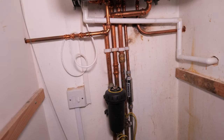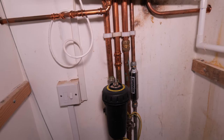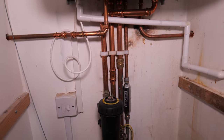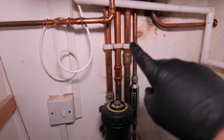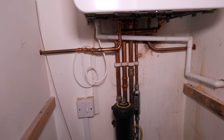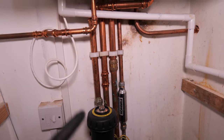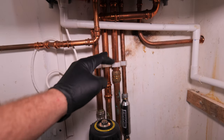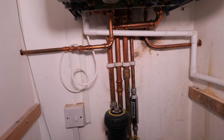One of the main things you need to do is add a zone valve on the flow coming out of the boiler. That will need wiring changes — linking it to your wireless room stat so it opens and closes depending on demand. We also need to put an auto bypass before the zone valve. The reason is to allow water to circulate if the zone valve shuts and the balance valve is shut on the underfloor heating manifold, otherwise you get water hammer against the zone valves. It relieves the boiler of heat using the pump overrun, opening the auto bypass to circulate hot water around this small circuit to cool the boiler and stop it overheating.